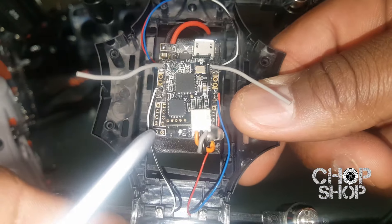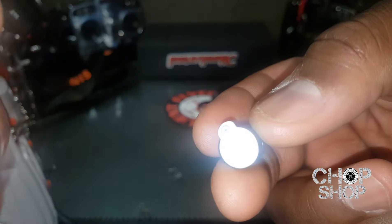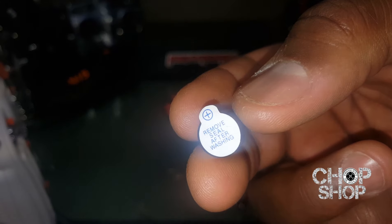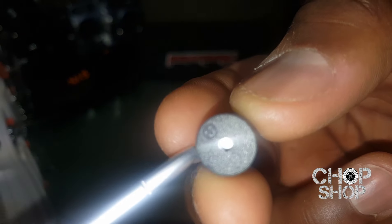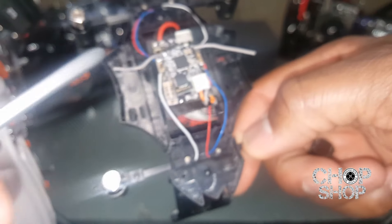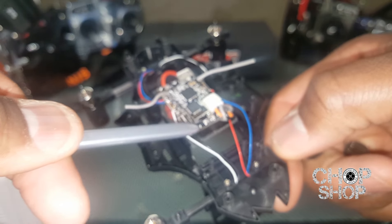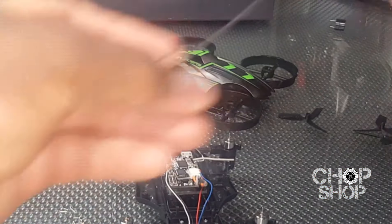The inside pad is where the cold wire or ground goes — so positive on the outside, negative on the inside. On these buzzers they always indicate on the top what side is the hot wire. As you can see there's a positive symbol there, and once you pull the sticker off there's a positive mark too. It's usually also the longest pin — the longest pin is always the positive. So we're going to add solder to the pads first, then tin the pins.